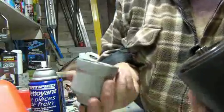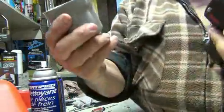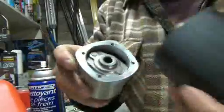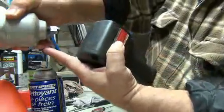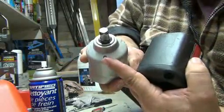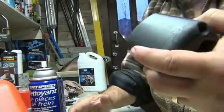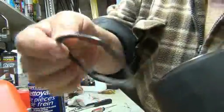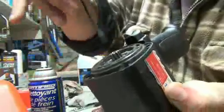Now again, just make sure you don't flip it upside down because everything will fall out. Now, this is shape smaller here, larger here, same as this. So therefore your grease port, if I can show it to you, your grease port here goes in the bottom of the gun. But before you do that, don't forget to put your gasket back on. Which again, the gasket is indented in one side. Make sure you put the indentation facing down on the gun.